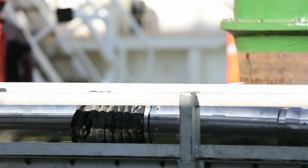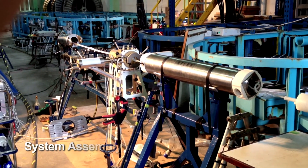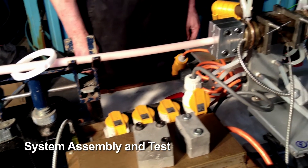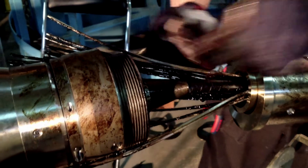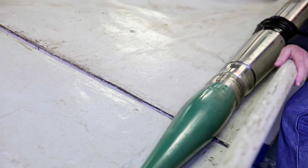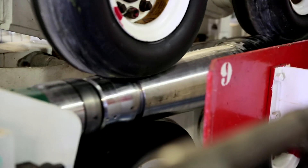What our customers always look for is a genuine sea trial because it gives them confidence that no matter what you do on land, the cable has been under the water and gone through all the rigors of deploying a system at sea. And ironically, that could include some of the low tension situations that happen before you go to sea — sometimes things at low tension can be more severe than at high tension because the cable can bend and create discontinuities.